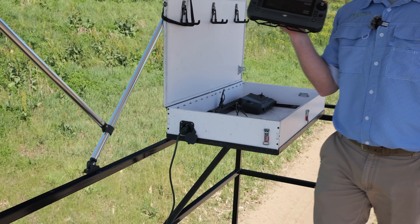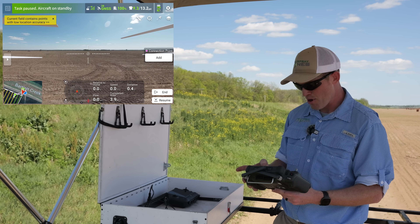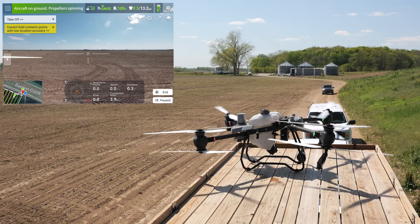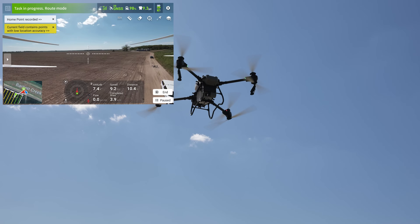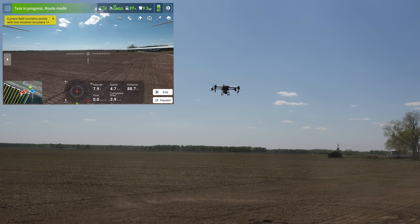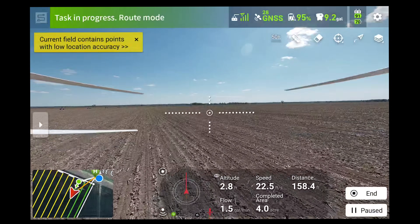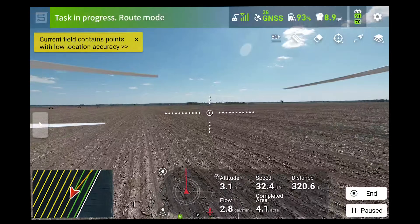The drone is booted up and has found its satellites — takes about 20 seconds. As soon as the tank weight returns to the remote, you have satellites. Swipe and the drone takes off and goes back to work. What you just saw is what we call one cycle — a takeoff-to-takeoff cycle. That's how you get your efficiency. The faster you can do takeoff-to-takeoff cycles and the more acres per cycle, the more acres per hour. Operating these drones is extremely simple — all you do is press takeoff, press land, and monitor while it goes.